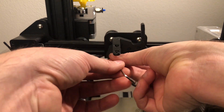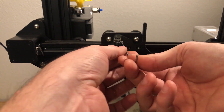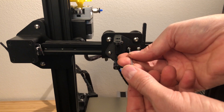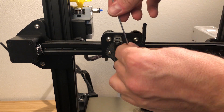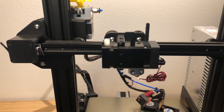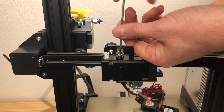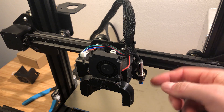The way I designed the mount is pretty simple. I reused the same holes in the mounting plate behind to attach a spacer that also serves as the mounting plate. I made two arms screwed onto the fixing points of the extruder itself, plus a support on the corner, and I also prepared a hole for a proximity sensor for bed leveling.